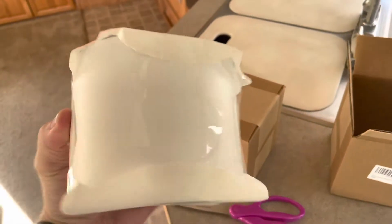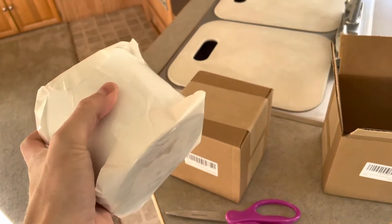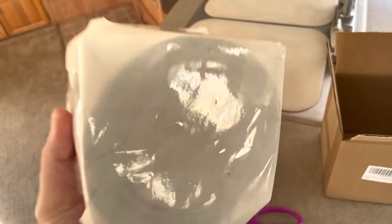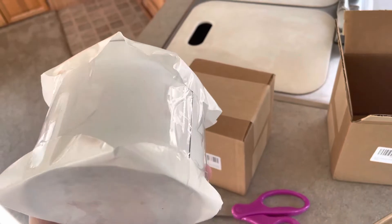This is a 10 year product. You can either cut it down to be a little bit more narrow depending on the area you're working on. You just go up there, clean up the area — you can lay this over your lap sealant, or you can clean off the lap sealant and put this on instead. It is UV resistant, and when it sticks, make sure it's where you want it to be, because it will stick for a long time.